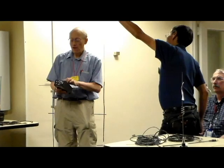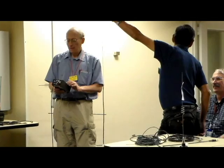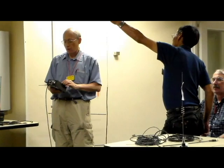4 to 1. I wouldn't use it. The rule of thumb is no worse than 3 to 1, but I'm picky. It's got to be 2 to 1. Yeah. But if it's an emergency, your handy talker's not going to fry. No. You'll still get the signal.